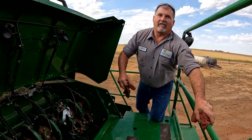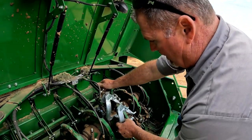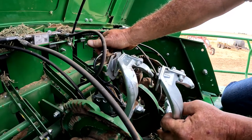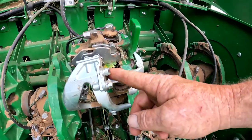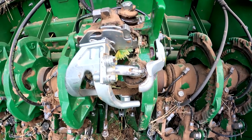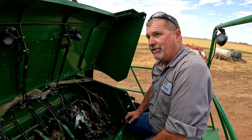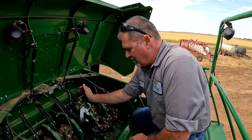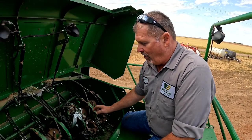You probably can't see the warp with the naked eye — you'd need some sort of measurement to figure it out — but I have changed a lot of these wiper arms when they're giving this problem and it fixes the knot hanging up in the bill hook. Right in that area the wiper plate is sitting somewhat out of angle in relationship to the bill hook. What would mainly warp a wiper arm is if it was ever adjusted too tight and came across and hit that bill hook really hard. It is pretty tight right now, probably a little tighter than it needs to be.